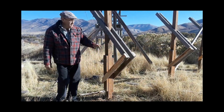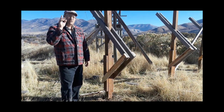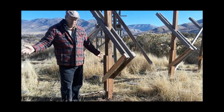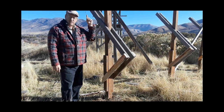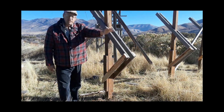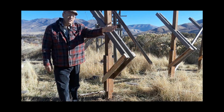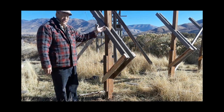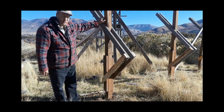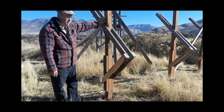The reason this is slanted is because the sun is in the south here in the wintertime and it's almost vertical in the summertime — nearly 90 degrees but not quite. It goes all the way down to about 23 and a half degrees at maximum in the wintertime. These are set at 45 degrees, which gives you a kind of in-between number for the solar panels.